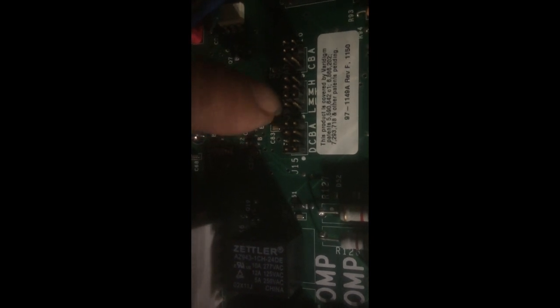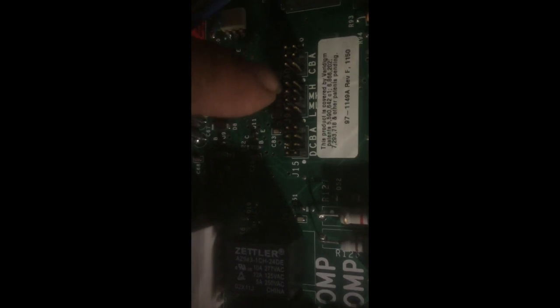I've already got it downloaded here on my computer so we can see where this 060 unit here, so these are our measurements. Next, we're going to confirm what speed we're on. So, our speed taps, our cool setting are these pins. We've got low. My jumper is on medium low, then medium high, and then high. You also have to look at the adjust jumper up here, which is a little bit hard to see in this scenario, but it's set on tap B.